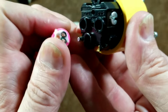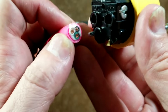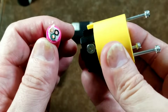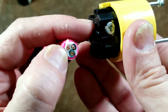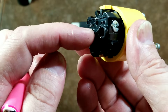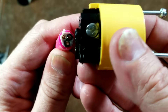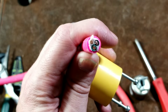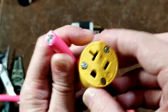But what happens is, as these are wound, on the other end the black and the white are reversed. So if this extension cord was assembled properly and I were to put the receptacle on the other end of the cord, in order to get the ground to face downwards, the black and the white would be on the wrong sides and I'd have to twist them over themselves to get them into the back of the plug, which is a bad idea. So you always want to pay attention that you're actually putting the receptacle on the proper end of the cord. It's surprising to think of a piece of three-conductor wire as having a front and a back, but it does, and it makes a difference when you're replacing cord ends.